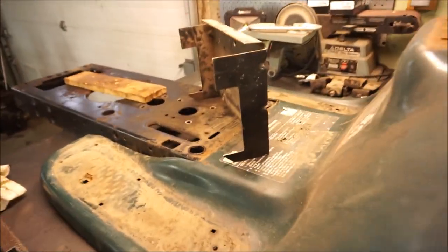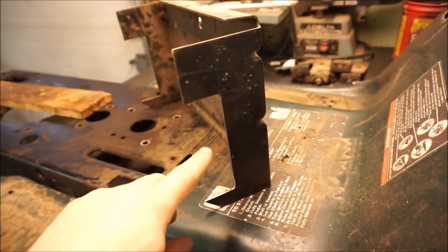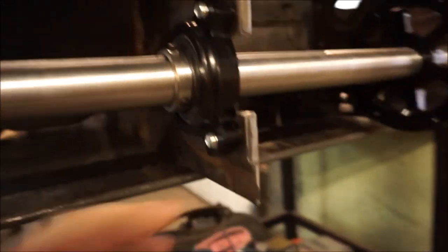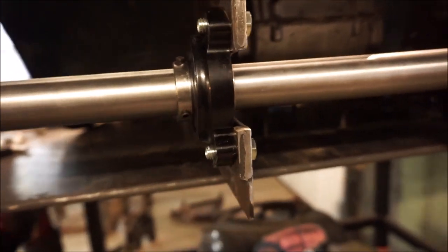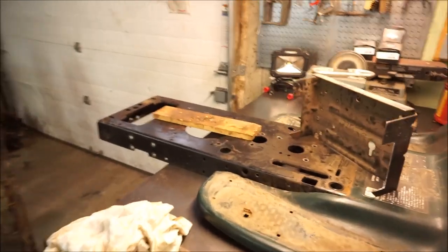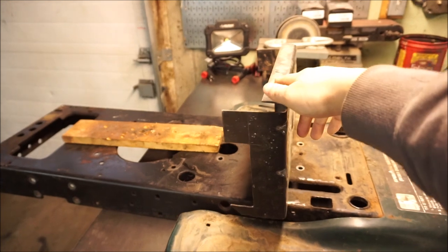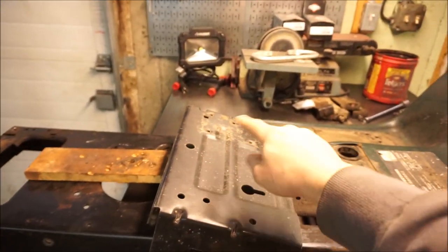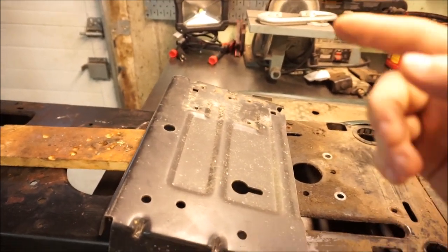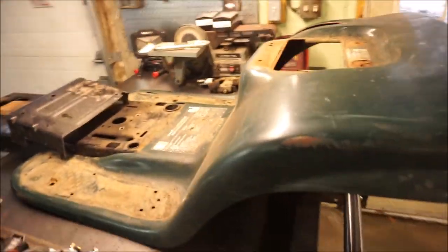I also had to customize these drawbars. Unfortunately, the bolts where they bolted on were where I had to cut out to make them fit around these cassette hangers — these are like quarter inch thick. So I had to modify those, which isn't ideal because usually these drawbars help square your whole rear frame up. Unfortunately these are going to basically just be a cover and not really structural. I'm also going to have to cut some slots and fill those in with chain guards for the sprocket and probably the disc brake as well.